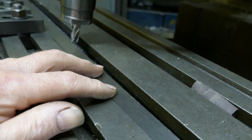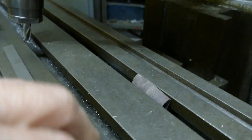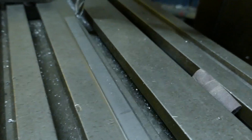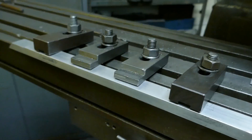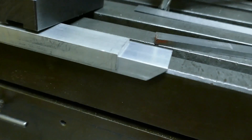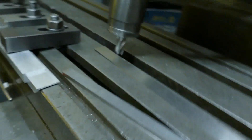It's going further along - you can see where the clamps are - and I'm using a small flat bar to go over the top. This is all metal-coloured here, it's really hard to distinguish what's what. That bar is going on top of the blade that I'm machining, and then the clamps are going over the top of that. I tried doing one without this bar, with just the clamps, and it only takes a little bit of flex between the clamps for the cutter to lift the metal up and dig in, and before you know it you've ruined the piece. So it needs the extra piece of metal on top to give the clamp some support, and it seems to work quite well.